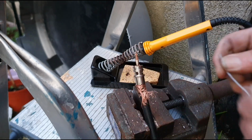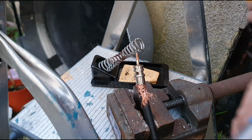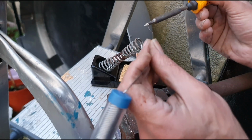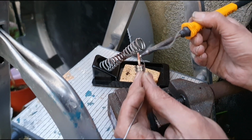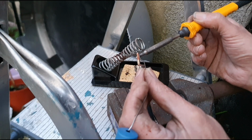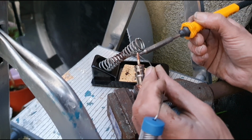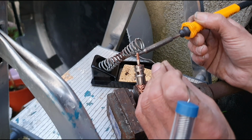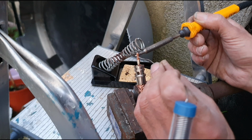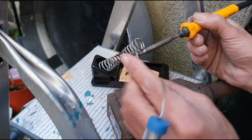Now it's not great soldering outdoors, but I'm doing this entire job outside, so see if we've got any heat on the iron, if we can manage it. Should have put my glasses on, but we'll do okay. So, a little bit of heat transferring from the iron to the bare wire. Get the conduction in place. And get the solder close by at all times, because we don't want to overheat it. So now we've got enough temperature to run that in nicely.